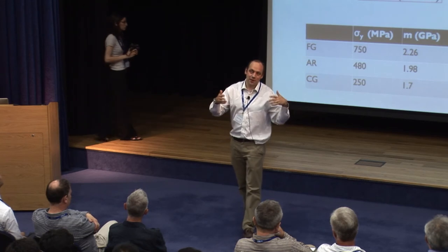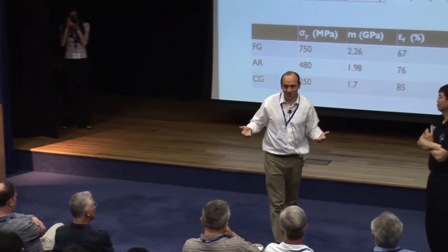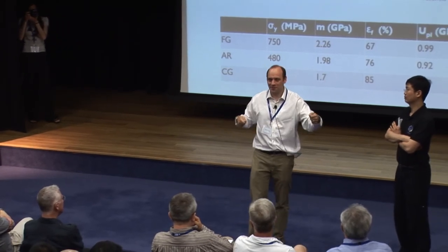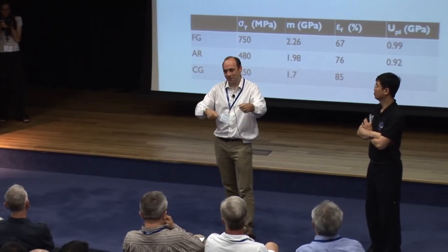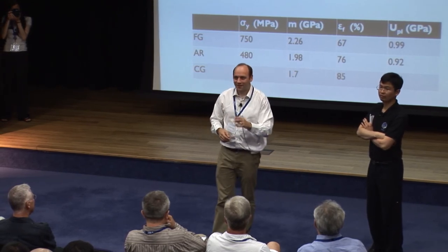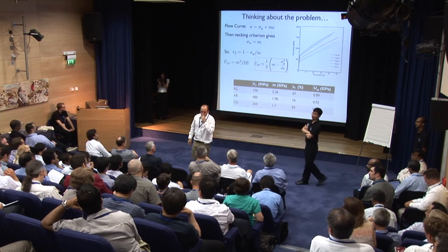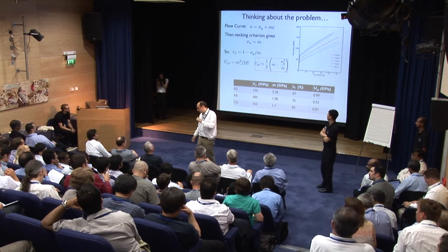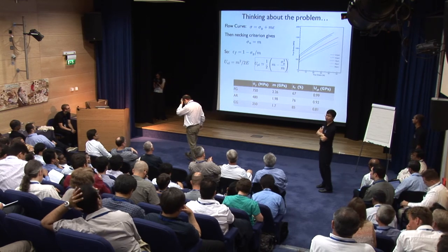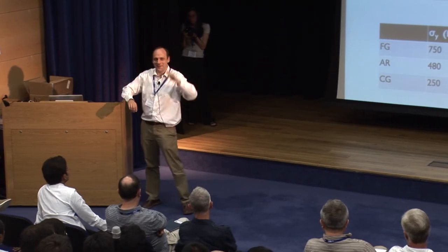One of the things is, because we're in a hot rolled recrystallized material, we have almost no starting texture, so you don't have to worry too much about texture effect. But we have gone and worried about texture effect a bit, and then decided we were being silly. The background behind the question is that you will reach necking point much faster than in uniaxial. Right, yeah. If you think about it from a metal forming perspective, if you're an auto guy, yes, you will.